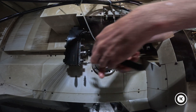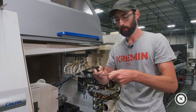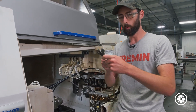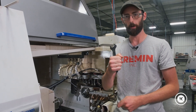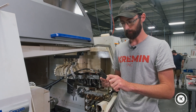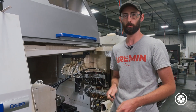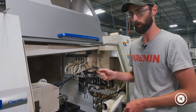When you're tightening your collets, you saw what I did — I had both wrenches in one hand. Do not have wrenches in other hands because inevitably one of them is going to slip and you're going to stick boring bars in your knuckles. I've done it. I have the scars. I have end mill pieces in my other finger. That drill goes right in your hand, that boring bar goes right in your knuckle, and they don't heal well with all the oil.